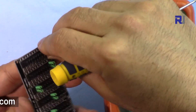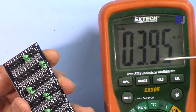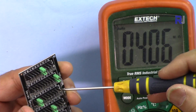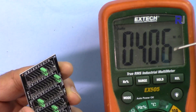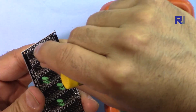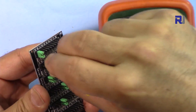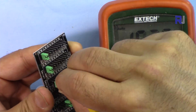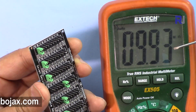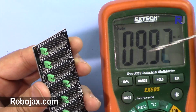The same way if you go for the mega ohm range — let me put it here at 3.9 or 4 mega ohm. As you can see it's 4.08, so that's 4.06 — as you can see, one percent accuracy. If you calculate the one percent you will see it. Now if I put it here we get 9 mega ohm, and let me increase it to the max — it shows 9.993, so 9.99, and you can see it's very accurate.